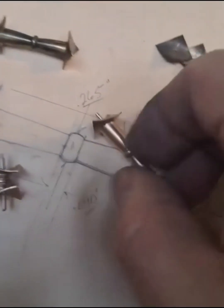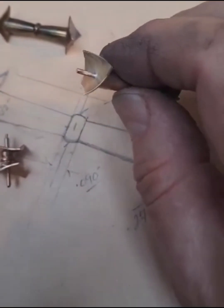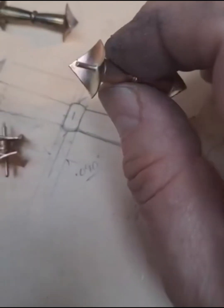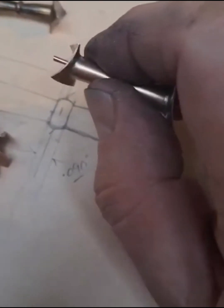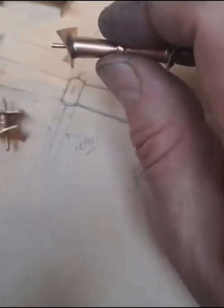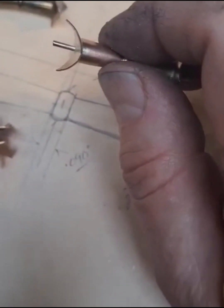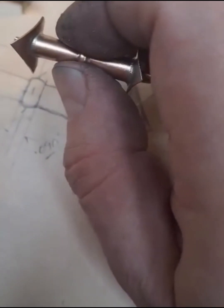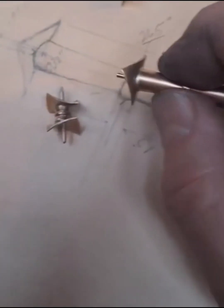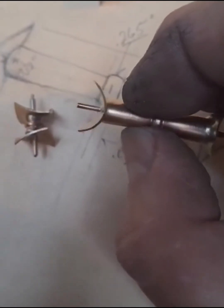Anyway, so next step is to grind off the pins. I'll just use a parting disc on my Dremel probably. And then everything cleaned up, I'll use a safety file around the edges of the flanges to square them up nicely. And then if I have to make any other adjustments, like grinding a little tiny bit out of the undersides of the flanges, whatever, if I need a little extra room, I can do that. But for the most part, these should slip right into place because they are the right geometry. We'll see.